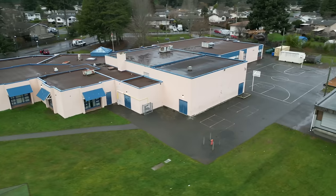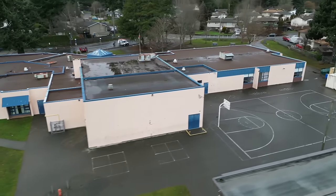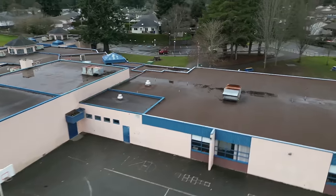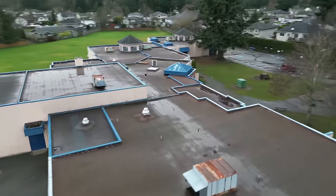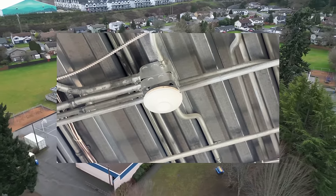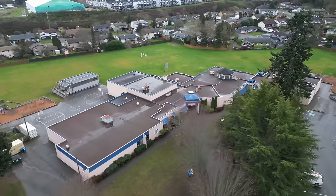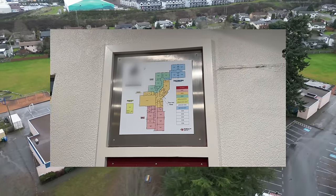This project is replacing the fire alarm system and installing a Notifier addressable full swap system. We will be replacing all of the bells, and have replaced most of them, as well as all the initiating devices such as pull stations, heat detectors, and smoke detectors. Because the original system was a conventional system we have all conventional devices, so to make this a full addressable swap we have to change all those out and install isolators isolating the old conventional zones.